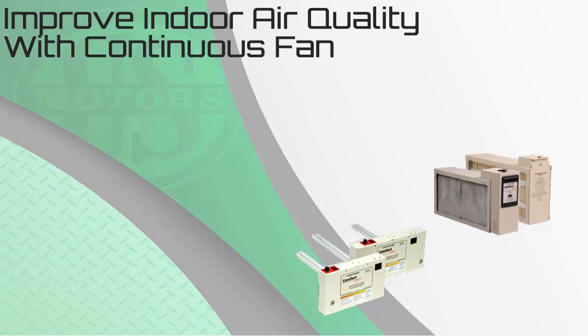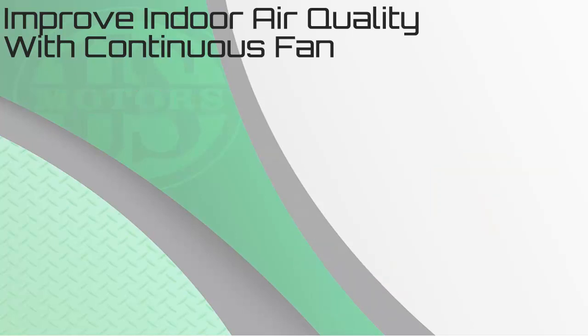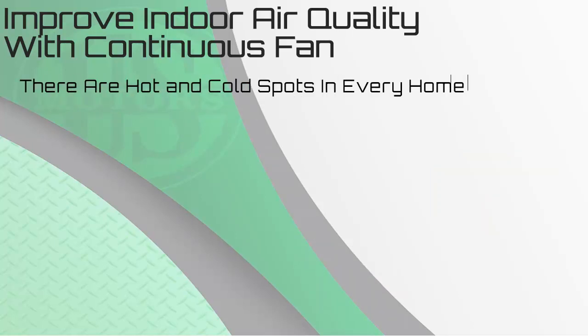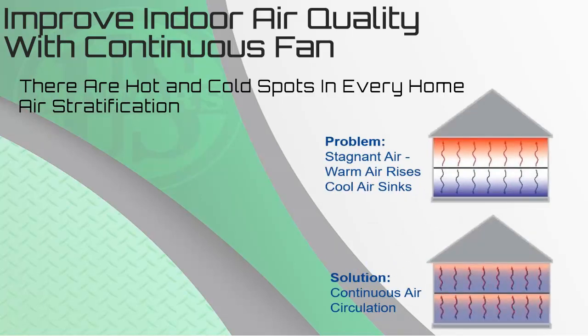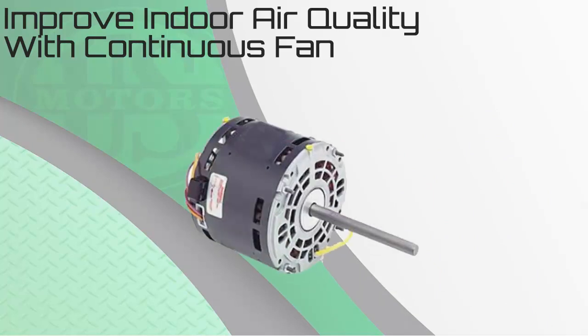All these products are great, however, indoor air quality products only work when the system is operating. Another top complaint heard from homeowners are locations in every home which are hot in the summer and cold in the winter, also known as air stratification. All of these issues can be helped by running the system in continuous fan or constant fan mode. However, many older systems are operated with PSC or permanent split capacitor motors, and the fan speed is generally the same as the heat speed.